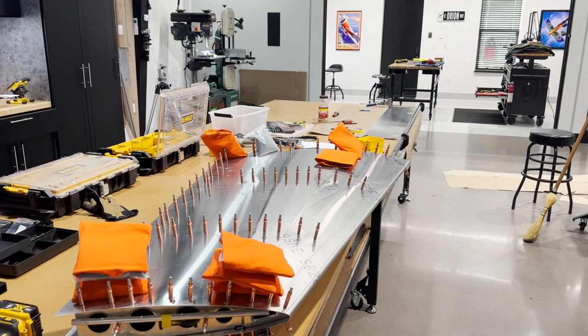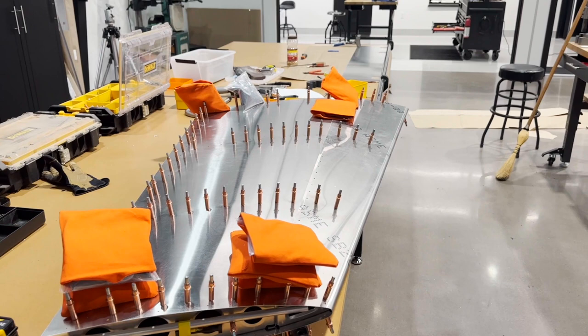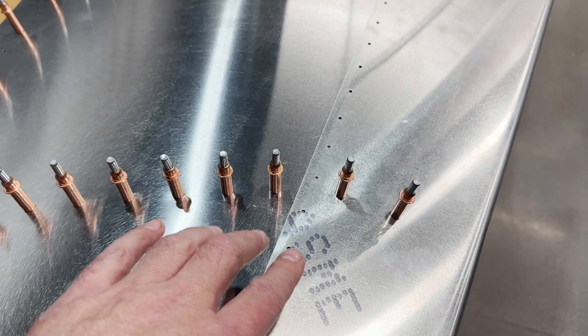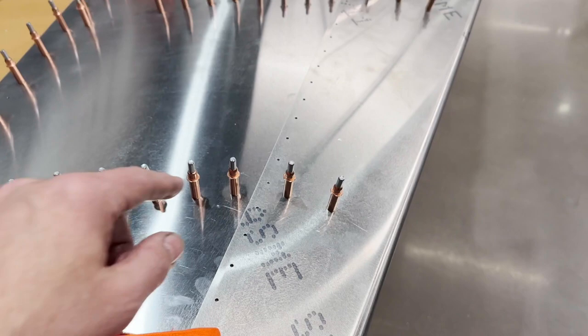It's amazing that even though the one side is Clicoed, when I needed to add that shim right there, when I added that shim and I picked that up and slid that shim in, I could actually see just a little bit of a shearing movement between these two panels. It wasn't much, but I could see it. I could visually see it.